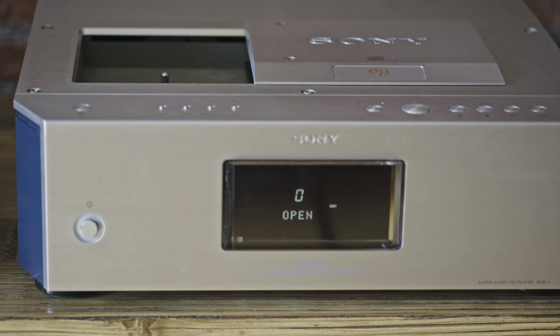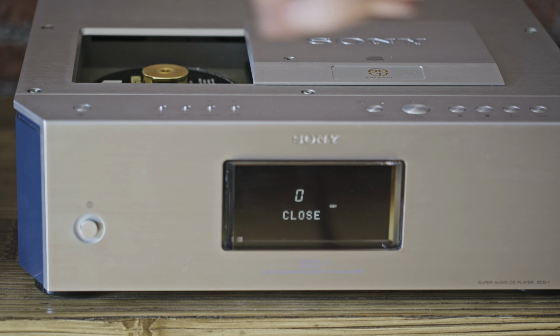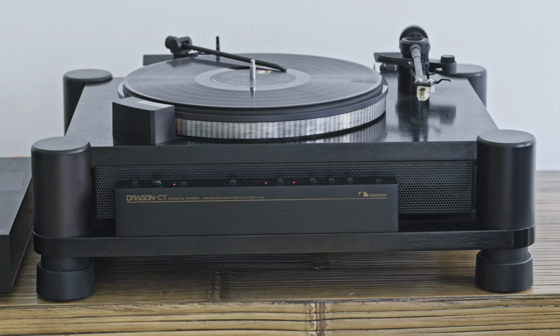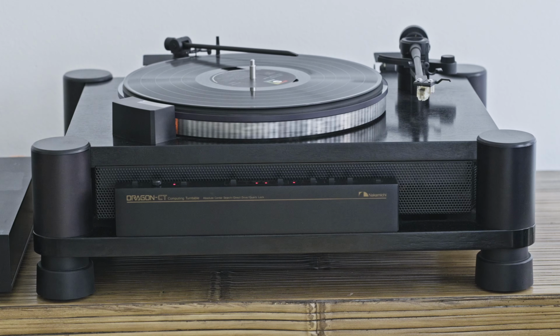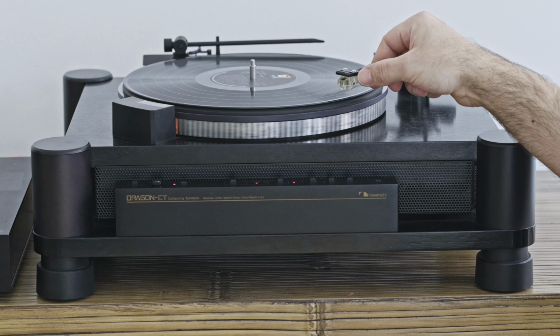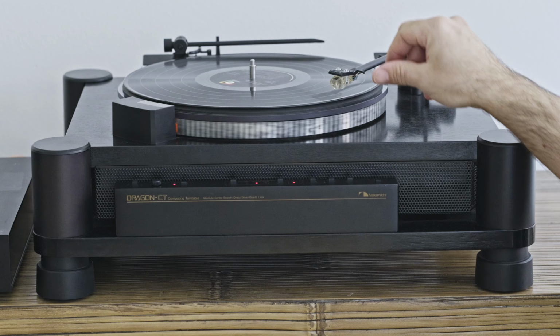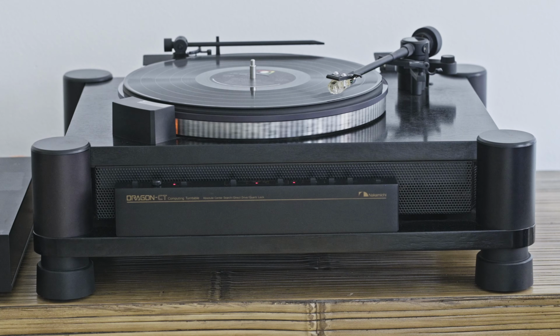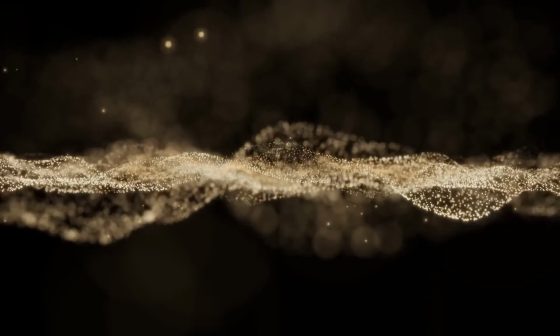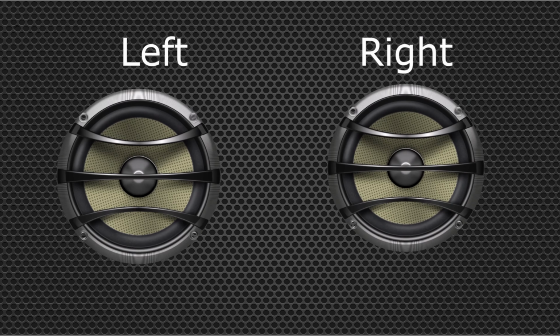Now, CDs being digital, frequency response is quite straightforward, between 5Hz and 20kHz. Vinyl records are analog, and as such, they're a bit more difficult to measure, but the lower end should be also somewhere around 5Hz, and upper end is pretty much unlimited. Which makes either CD or vinyl record far exceed my own hearing, and pretty much hearing of 99.99% of the population. Since the human's hearing capability is far worse than what either CDs or vinyl records produce, nobody can hear the difference concerning the frequency response. Where you can hear the difference, however, is the noise, dynamic range, and stereo separation.